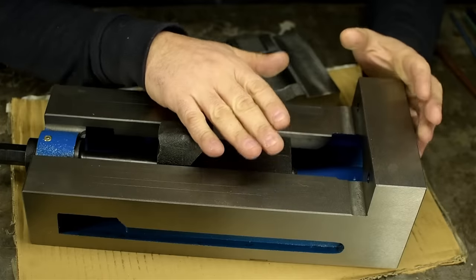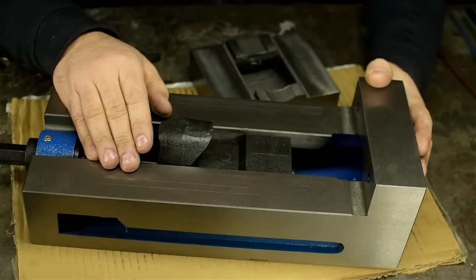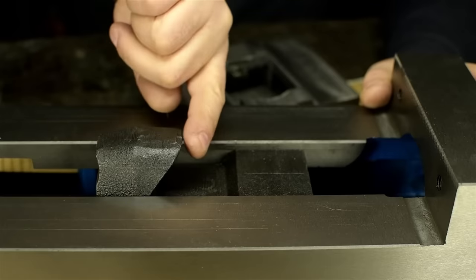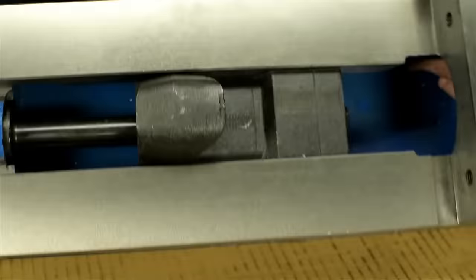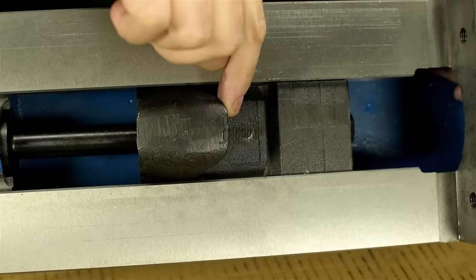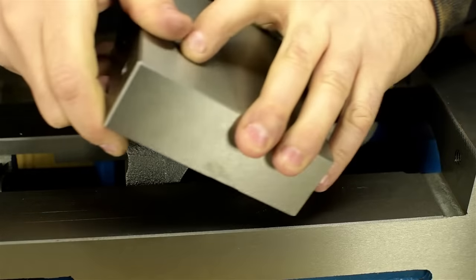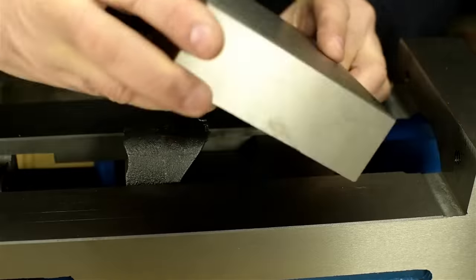But now I realize why it's called a eunuch body. This vise has no ball. Let's talk just a minute about this angle lock feature that's been plagiarized into this vise. See how the nut on this vise screw has an angled surface? A greasy angled surface. The nut that rides on the screw engages with the moving jaw via that angled surface. The inside of the moving jaw has an undercut that matches that surface. So this sort of hooks on and drops down. It's caught under that surface.